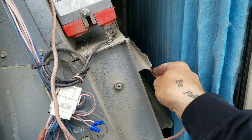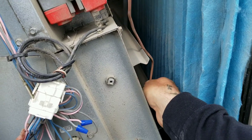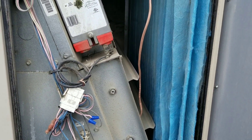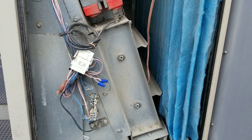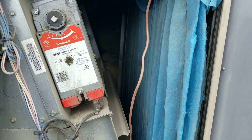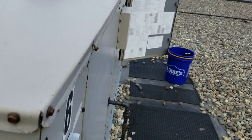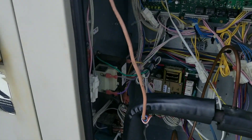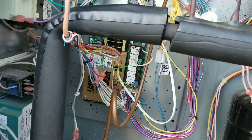Also, while you're doing this, make sure on the thermostat before you drop it down that if it's a programmable thermostat, you have it programmed properly. Make sure you have the fan continuously on so air is constantly circulating through that vent so that thermostat can sense it a little bit better. What I did — I just popped the top of this and ran my thermostat wire up through the unit. It really only takes five minutes rather than leaving it on the outside and running it over or under the machine.